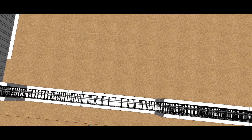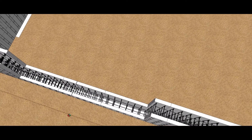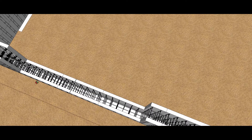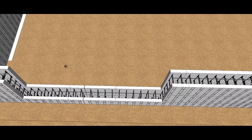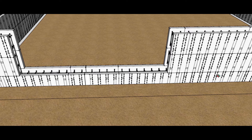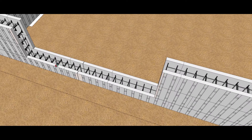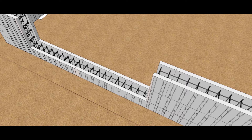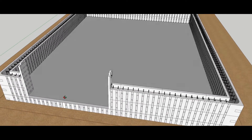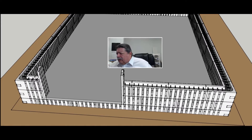In this particular case, I actually backfilled the front of this building empty — I was only going up one course, and as long as you backfill it evenly on both sides the block will handle the pressure. You don't have to do it that way — you can put a two by four stiffener and stake it back. Generally we're not going to pull a truck in to pour just two courses, so a lot of times we can do this whether we backfill first or not.